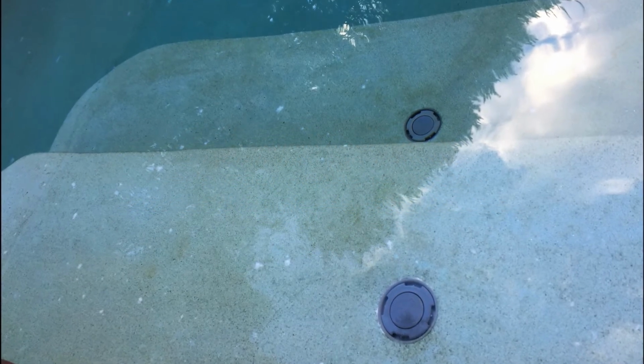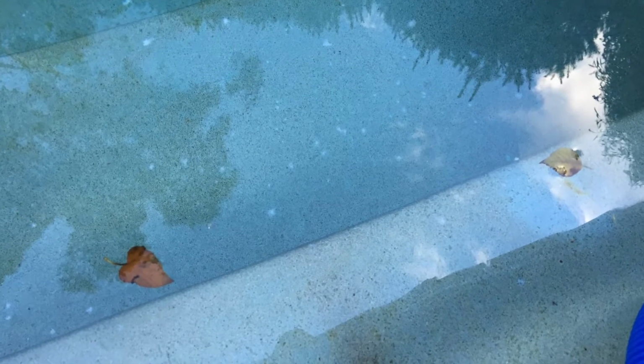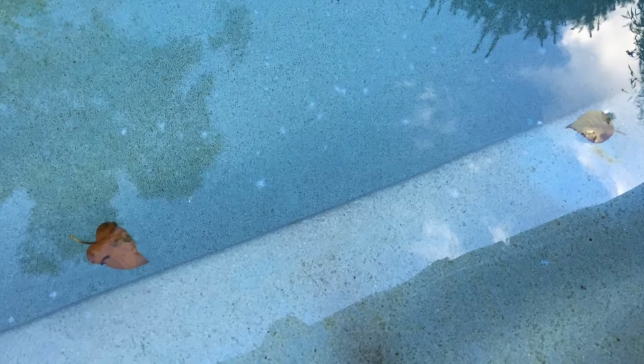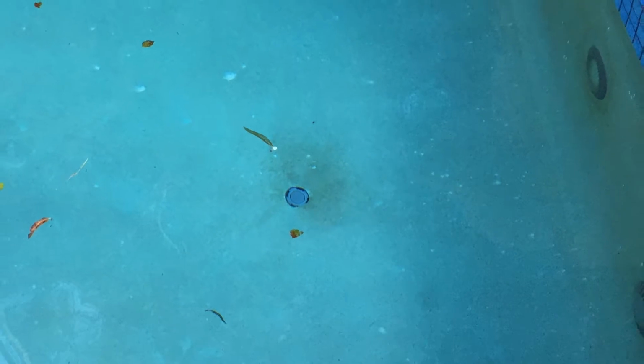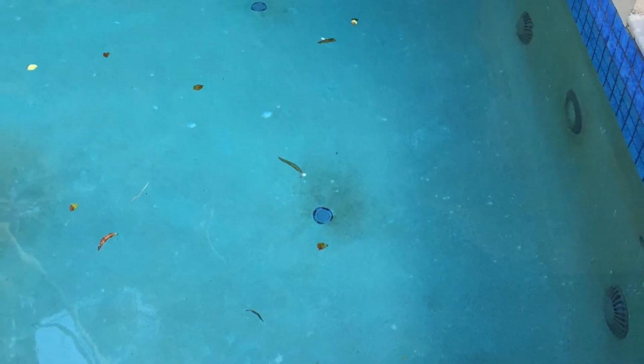The other thing is you need to know about the surface of the swimming pool. Some surfaces, like a marble sheen surface or a fiberglass surface, are quite reactive, and these surfaces react with the water and the pH, the calcium, and all the rest of it in a swimming pool, and they can tend to stain. One of the biggest reasons for an empty and acid wash is if a pool's been left to go green and has been that way for a very long period of time, the walls will be stained, and they will actually need a severe way of getting them clean.